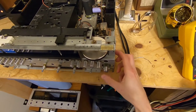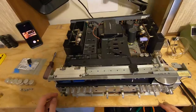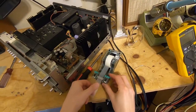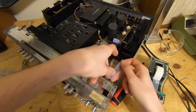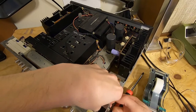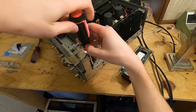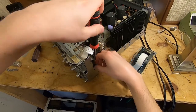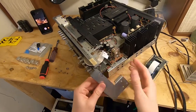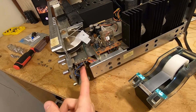So there it is right there — this is not a good switch, you don't want that. Next thing we do is begin to remove this plate. To make this a little easier, I'm going to take a piece of scotch tape and put it around this pulley here to keep the string in place. And there you have it — now we see a clear path to the power switch.